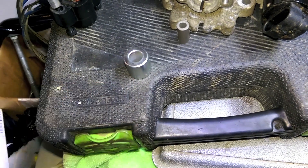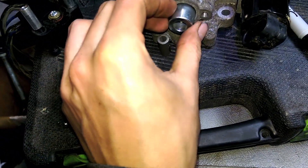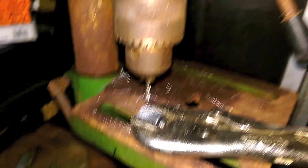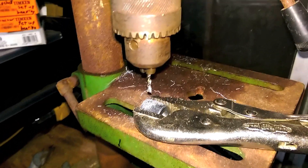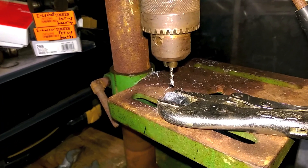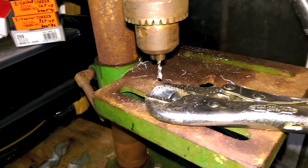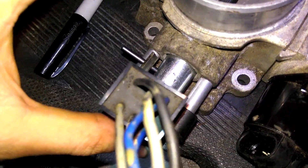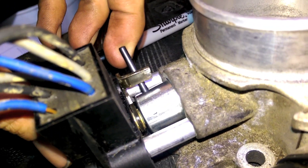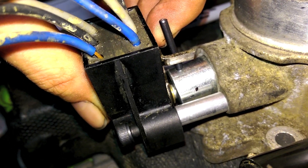Next step is to drill a hole for the set screw and another for the roll pin. We got our tube drilled out on the drill press. Interesting note: the roll pin is 1/8 inch and the drill bit is also 1/8 inch, but the roll pin is actually about 10 thou bigger than 1/8 inch, so when you hammer it in it's a tight fit. You don't need to go a step smaller. By adjusting this as far back as we'd probably need it we can still get to it from the top, so I put a mark there.